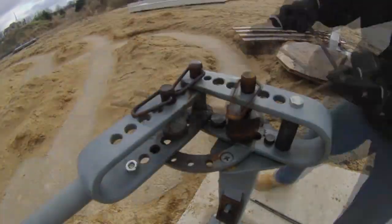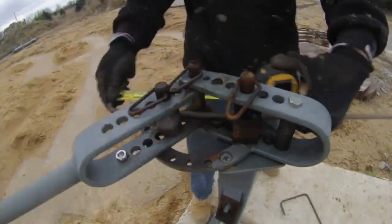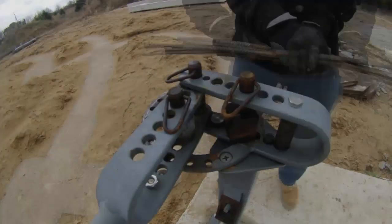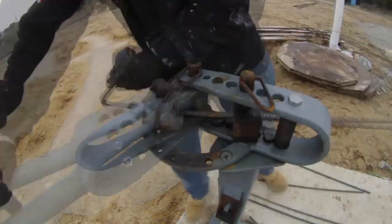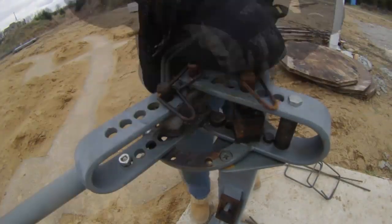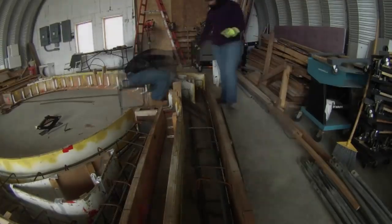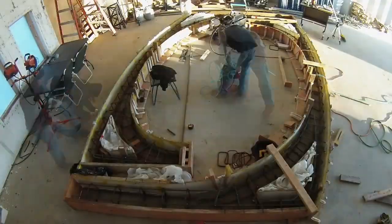Back to rebar work. I was pretty tired of it by now, but pretty good with a rebar bender. I used it to make stirrups and tighter bends on the longer pieces. I liked welding that previous set, and I really liked how it stiffened up the rebar assembly, so I did it again here for the fourth set.